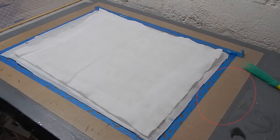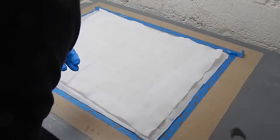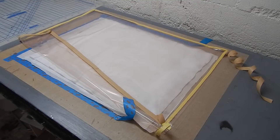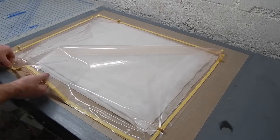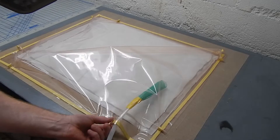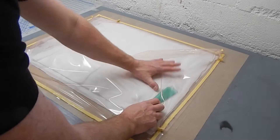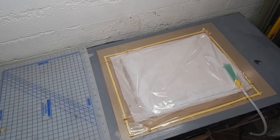There's a P3 release film and this breather. I've made a bit of a mess where I was putting my pot on the side, and it's really important to clean up that resin before trying to put the bag down, because the sealant tape will absolutely not stick to resin. So I put masking tape around the perimeter just to make sure I have a clean landing zone for the sealant tape — even once you've wiped up resin with acetone, there's still residue. For the vacuum fitting, it's just a piece of infusion hose with some mesh wrapped around it. You can wrap breather around it too, but keep it off the part because the bag will push it in and make a mess of your surface.